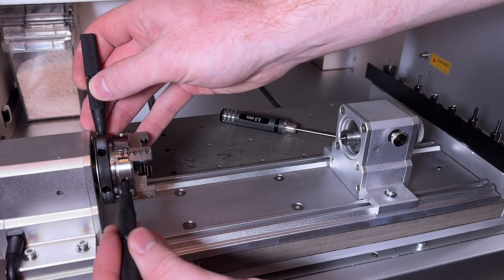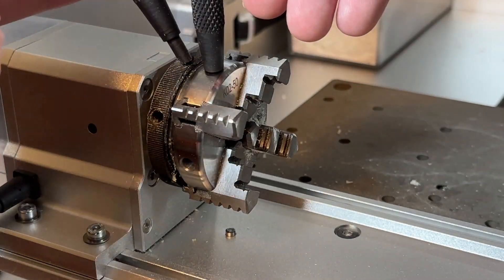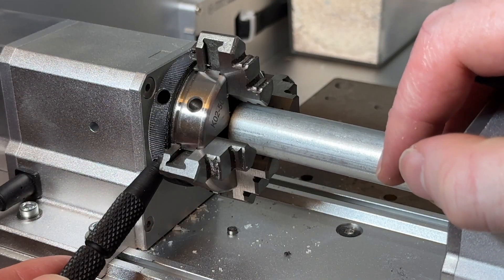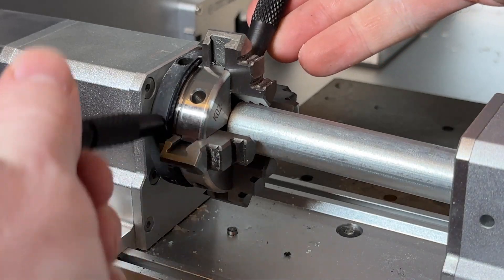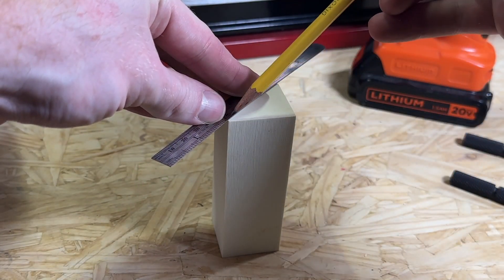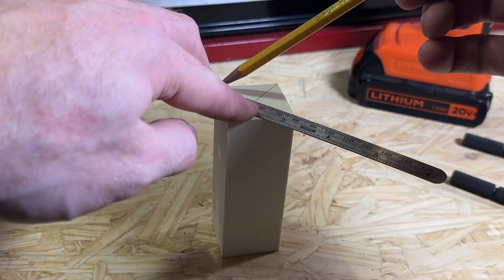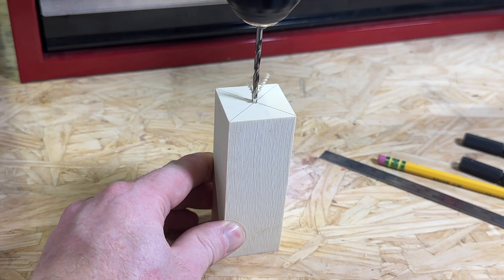Like the original, the chuck jaws of the rotary module can be tightened and loosened using the two wrenches provided. Rotating the wrenches towards each other will close and tighten the stock, while rotating away will open the chuck. The jaws can also be removed and reinstalled in a different configuration to secure stock of different sizes. You can also use the rotation example file already on your Carvera to test the new 4th axis with harmonic drive. To secure a typical piece of stock, always find the center point on one edge first, and we recommend drilling a small hole at the center point to assist with securing it in the tailstock.